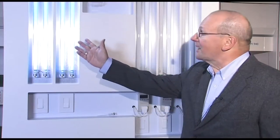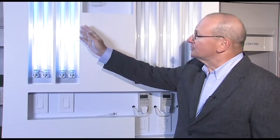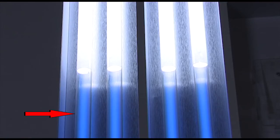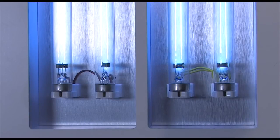That's the components of a fluorescent light delivery system. This is an operating fluorescent lamp. It happens to be half coated, so the bottom half here is clear. The upper half is coated with phosphors. This blue emission right here you can see is the electrical arc stream, and that is exciting the gases and the mercury to a higher energy state so that they can cause those phosphors to glow and create visible light.